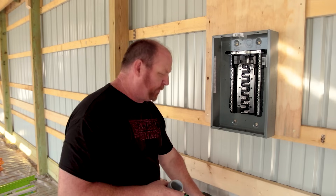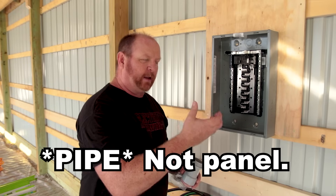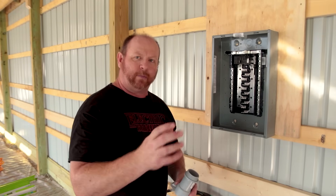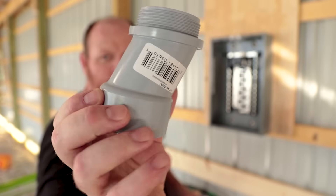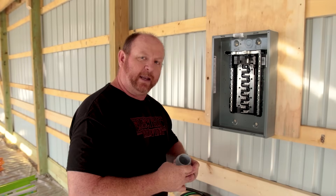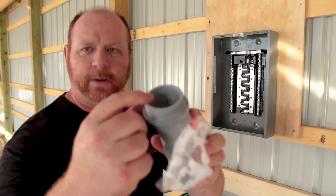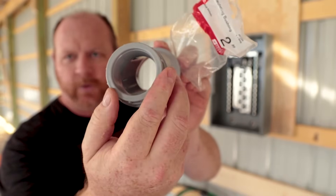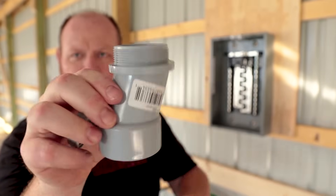When I come up from the conduit below, I'll need to put an extension panel in there. Because the panel is a little bit out from the wall and I've got the pipe coming in the barn fastened to the wall, I'm going to use one of these offset connectors. And one of the things you want to put in the top of that is one of these bushings, because the edges can be pretty sharp — this bushing will make it smooth on the inside so you don't have any issues with your wire getting cut.